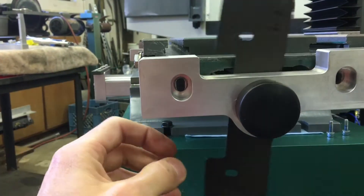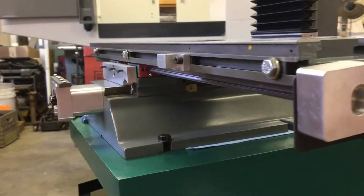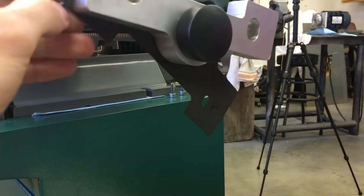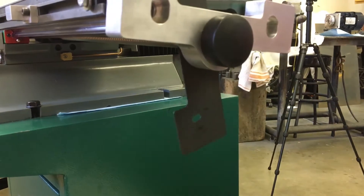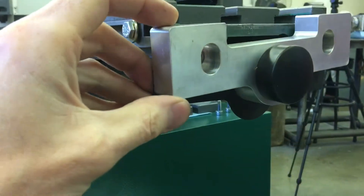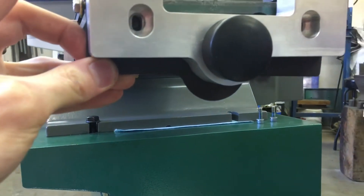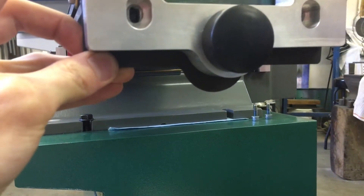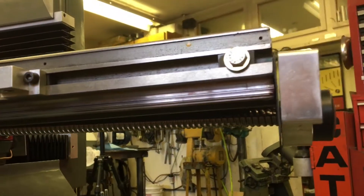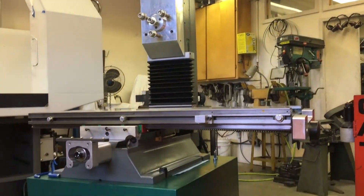I also made — you can see — here's a steel plate. The thought behind it was to try to keep a coolant slinger from rolling over the edge. It's a drip edge — you know how a drip edge works, like flashing? Same thing with a coolant slinger. So you can see when this is all bolted together, that edge right there hangs down and water can't wick up the backside and then down the rails and down the screws. There's also a trough that goes along the front — we'll see that here in maybe a week or so.